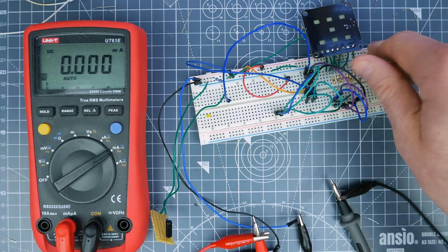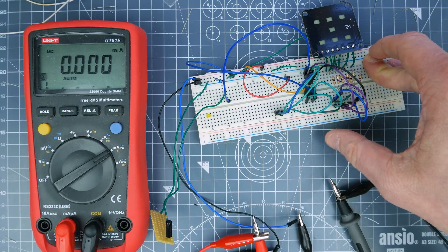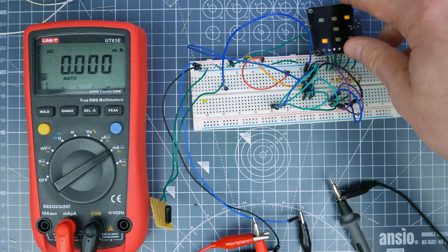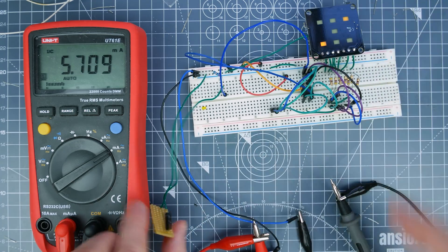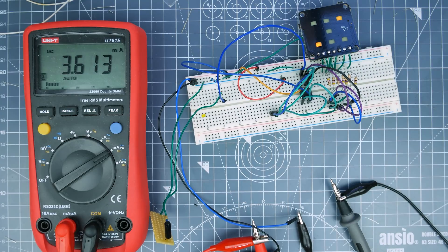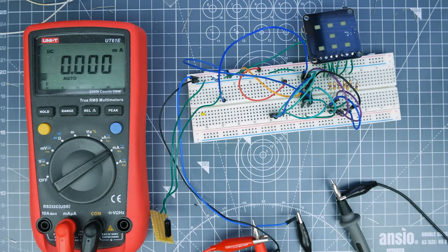It's running off four pins available for the LEDs and one pin for the shake switch — five pins in total. The ATtiny85 has eight pins, leaving three for VCC, ground, and reset. Reset isn't being used for anything, but we can't really use it if we want to reprogram the microcontroller. It's now just using an ATtiny85 — thanks to comments from you guys suggesting we don't need a 74HC595, which would have been a lot higher power overall.